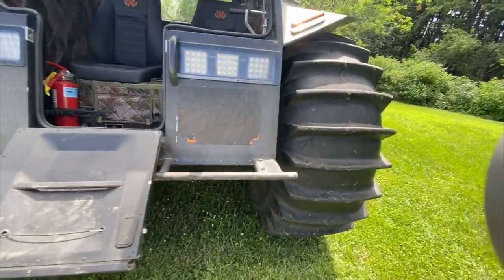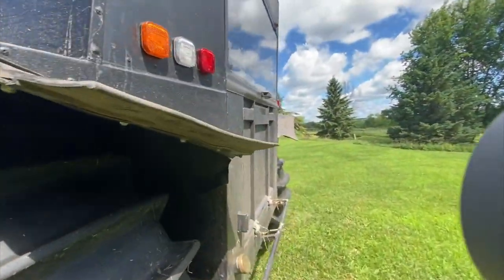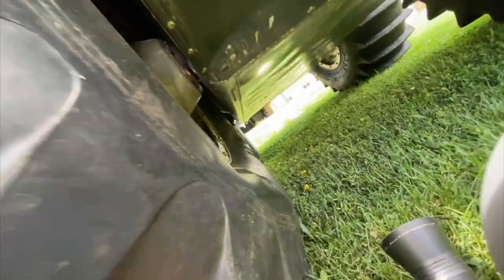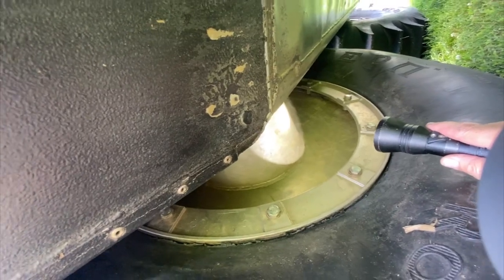Because those Zerks are not in the exact same spot on every one, you have to get off and move it backwards a little bit in order to get it in the right spot. We got one right now — hopefully you can see that right there. We got a Zerk right up there — see it? Right where that blue stuff is. We'll get that one done and then move it again and get the other two.